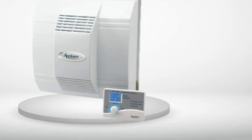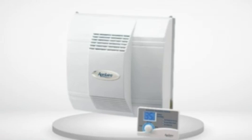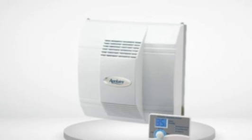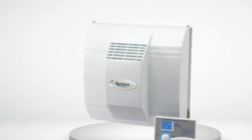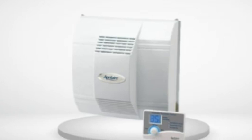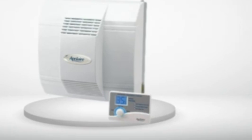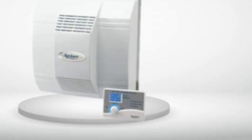I read all the reviews, and one solution is to wire into the furnace control board. I found this rather difficult because I couldn't find the furnace board specifications. The solution I found is to install a delay-on-make timer with 0.03 to 10 minute adjustable delay and 6-inch wire leads, universal 18 to 240 VAC. You can get this timer on Amazon for approximately $15, to install between the humidistat outputs and one of the solenoid lines. I adjusted the time to 3 minutes so the RH inside the duct system can stabilize before calling for humidity. Since then, the humidifier does not blow air into the system when the furnace fan is not running, and also waits long enough to allow the RH inside the duct to stabilize.